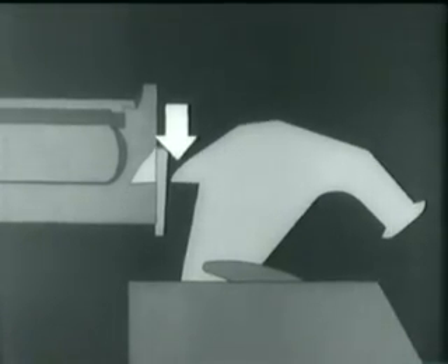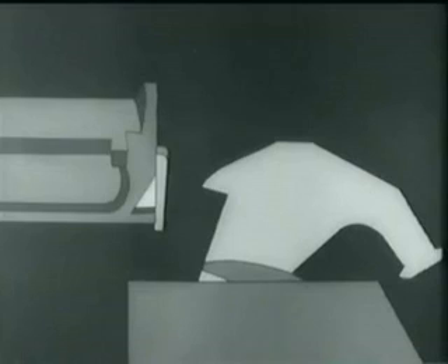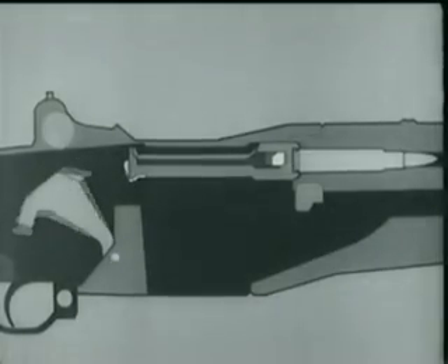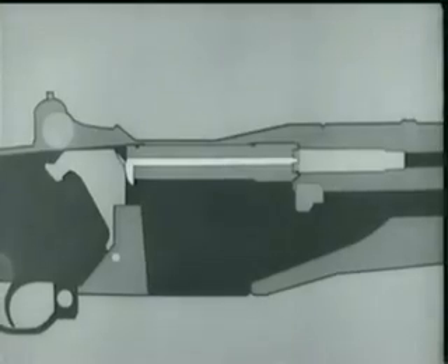Here's a safety point in case the bolt is not locked. The bolt camming lug on the left side of the hammer engages in the cutaway portion on the bolt. If the bolt is not completely locked, either the lug will cam it into lock position, or the hammer will not strike the firing pin tang. Now back to the hammer again. The lug engages the cutaway portion of the bolt, and the hammer strikes the firing pin tang, driving the firing pin through the face of the bolt and igniting the round.